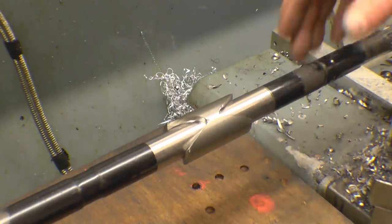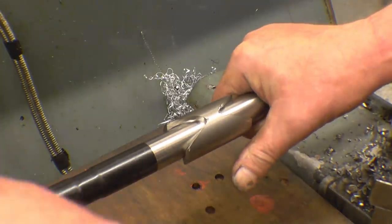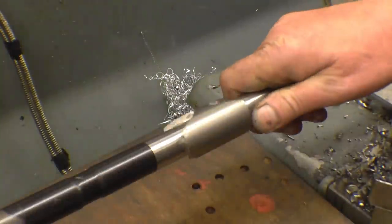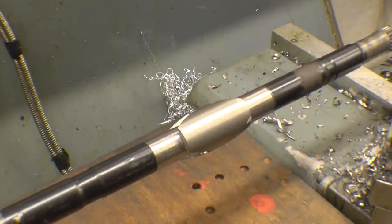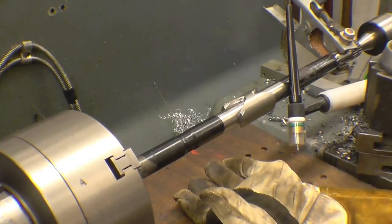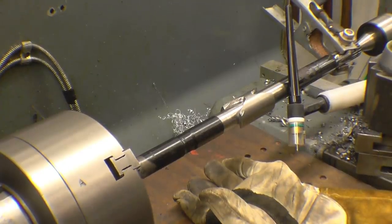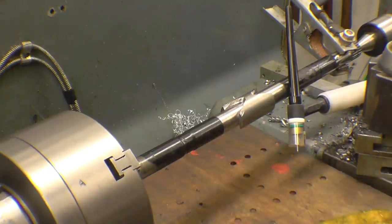You can weld in the lathe as long as you make sure your earth is on the shaft, not the lathe. Obviously you don't want amperage going through your lathe bearings. As long as the earth's on there, it'll not be a problem. I've done it plenty of times before. The rods I'm going to use are designed specifically for welding dissimilar metals, because I've got no idea what any of this lot is. Just stainless base rod.